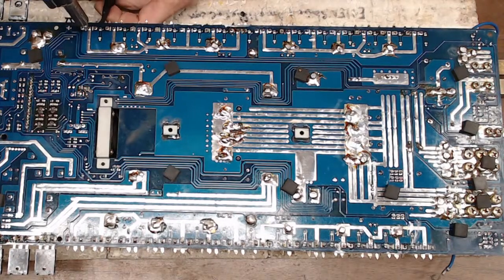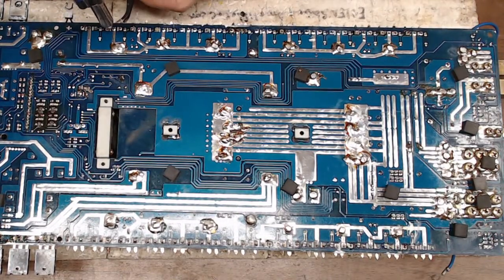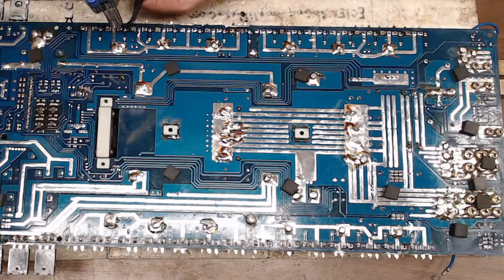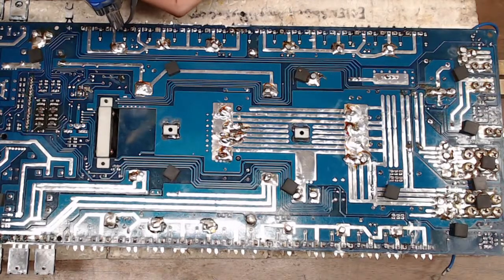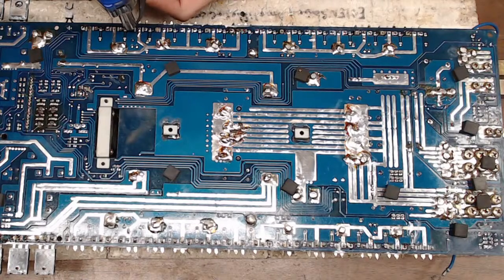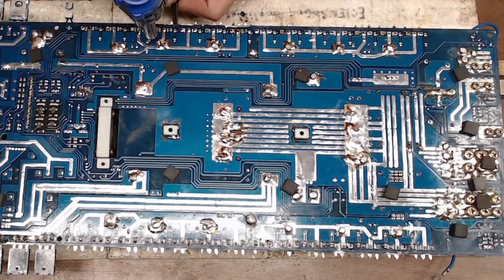And then, of course, this is, I don't want to say the tedious part, but if you cut the transistor out first, this does go by pretty quick, as long as the legs aren't welded, I should say, into the via. There's some times where your via would get so hot that the leg will weld itself to that copper. Some of these have been a little toasty.